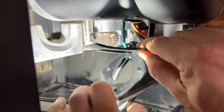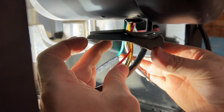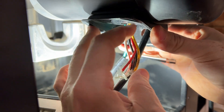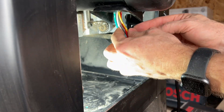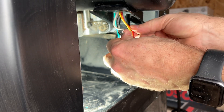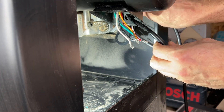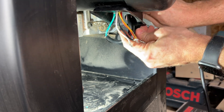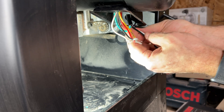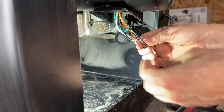There's a gasket here that goes between the motor and the junction box — just a rubber gasket. The wires slide through that new hole. Then we'll put these screws back in. Now we can make our other connections — the ground is securely attached to the motor housing. We'll separate everything. There's a lot of extra cable in here; it just made it easier to get the green going. You don't really need that much sheathing inside the box, but you do want a little bit.